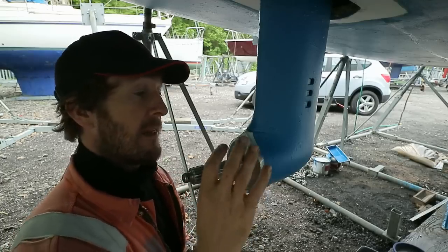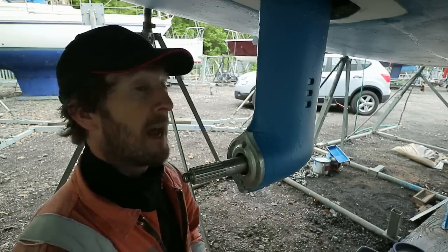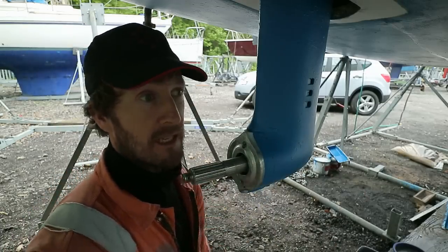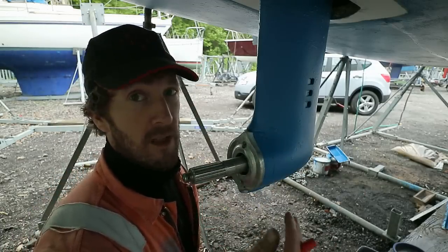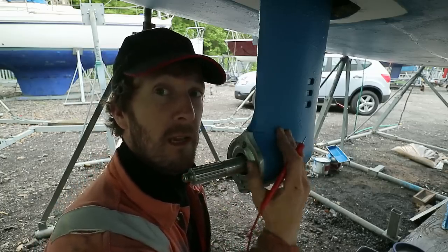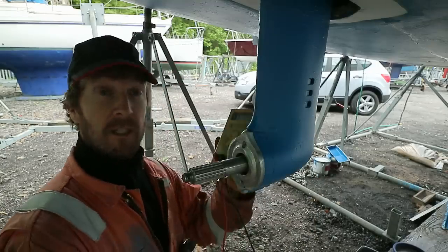It can happen that you reconnect the anode, and if you measure that, you might get 10 ohms. If I were to walk around this boatyard now and measure the resistance between the anode and the things they're protecting, you will quite often find that they're not actually doing anything because they're just sitting there, but not connected properly electrically. So you don't have the protection that you want. So it's worth spending 2 minutes to check.